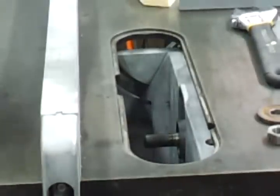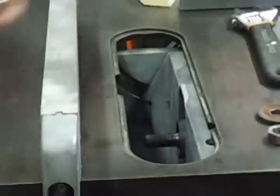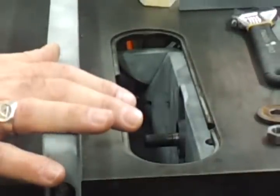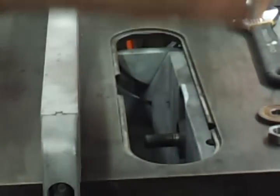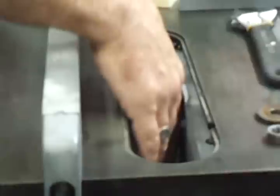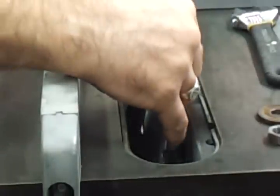I had checked the distance on the inside to make sure I could go an eighth inch bigger — because that's what it would be, an eighth inch on either side. This is an eight inch table saw, and I went with an eight and a quarter inch blade. Now when you're pushing your wood through, if the arrows have worn off, you want the blade to be cutting downward. Check which way your centerpiece is rolling — it should go with the arrows as indicated. If you were cutting upward, it would pop the material up and out of place, and you'd have a heck of a time cutting.